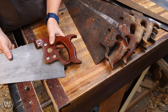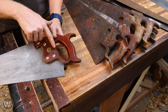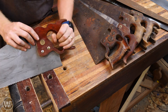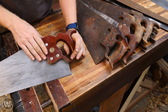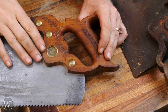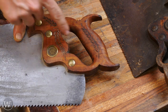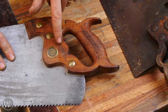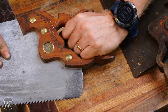Then you move on to a handle probably made in the seventies — it's a nice saw, okay. The radius here is different from here, and someone came through with a hand file and tapered out the router marks. There was some care put in this, and it's relatively comfortable, but there's still a sharp line your hand can feel. That's not a saw I'm terribly impressed with — it'll be a good user saw but not amazing. Then you get into handles like this Atkins — one of my all-time favorites, my big five-point rip saw. The radii are all drastically different, this entire handle was hand-sculpted with file and rasp. Someone really took a lot of care in this with hand carving throughout. You put it in your hand, it feels good — it's just a really nice handle that is going to treat you well.